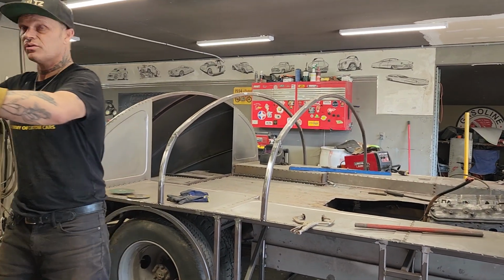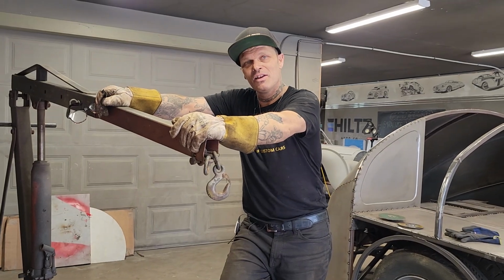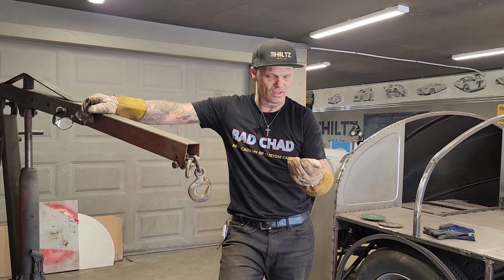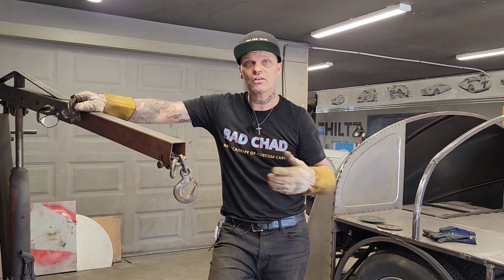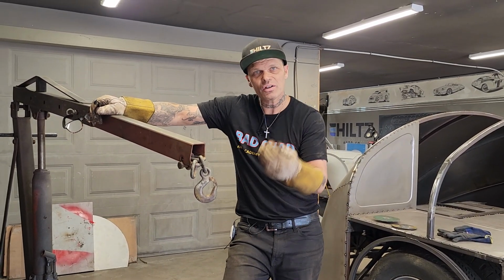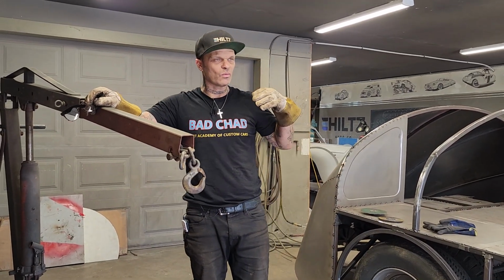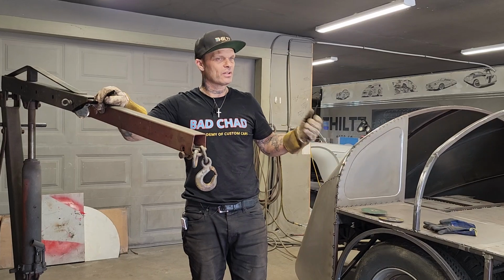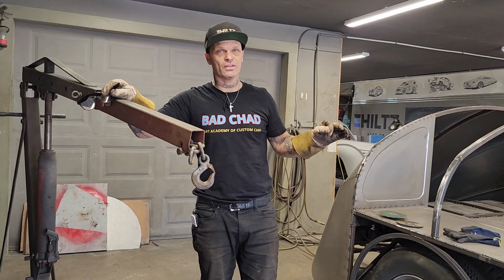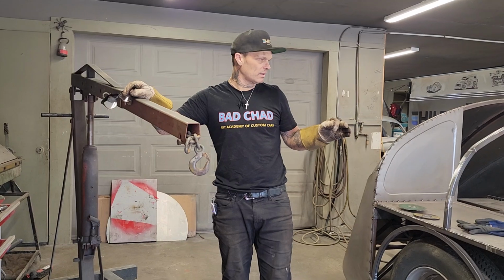And if you want to, you can throw your belly button in on the situation on the angle of the engine. We phoned Jim last night, and Jim said that engine should run upside down. Unless it was a dip motor, I guess. Sometimes, when we were at Knotnex, he showed me the crank on this engine. It had like a dip thing, like a little spoon thing that would throw oil on stuff. And if it had a crank in it like that, yeah, maybe. But this is a new engine where the oil pump is supplying all the bearings. The only way you're going to have any issues, I would say, is if the pump runs out of oil. And like Nathan said, if you think you're going to have a problem, add some more oil. Put another liter of oil in it. And I don't think we're going to have any problems.